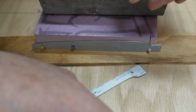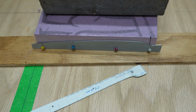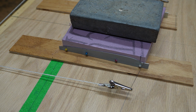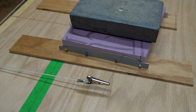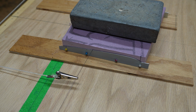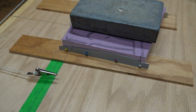So, it's coming though. Alright, let's pin this guy up, and we are going to set the bow back on the leading ledge of the templates. Now there's something I want you guys to notice here. How important it is to have a gentle slope on the front edge of the template, right there. That's really important. It's better to have more material to sand off than not enough. Here the feed speed is pretty good. That's dictated by the weight on the arm, by the way.